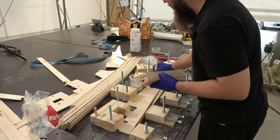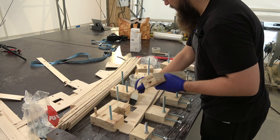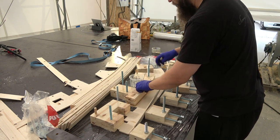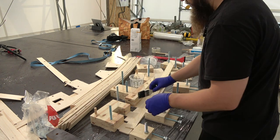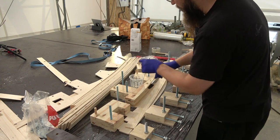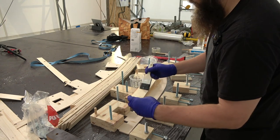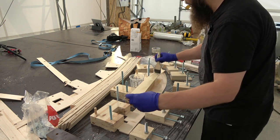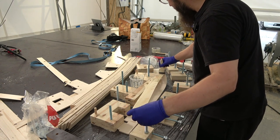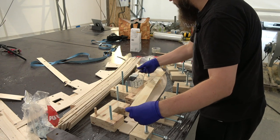What I have learned is that with wood you have to kind of wet it out so that the wood can absorb the epoxy enough. I think it's a good idea not to hold that cup in your hand when it's warm like this. This is a very smooth, plain surface, so it won't get that much absorbed, unlike the previous test when I had a very rough surface and there was quite a lot of epoxy going in there.